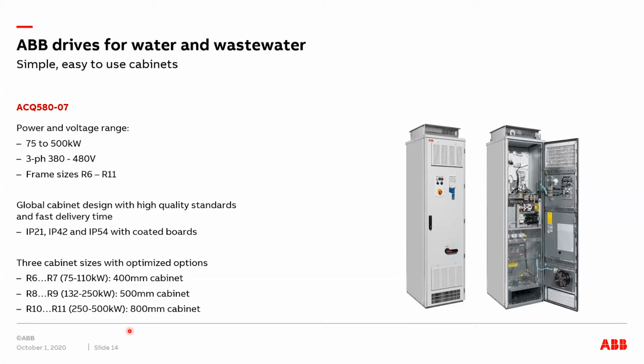And in total, there are 3 different frame sizes. There's actually more. There's R6 to the R11. So those are the ones, 75 to 110 kilowatt. That is basically 400 mil cabinets, then a 500 mil and an 800 mil. And the IP ratings available are IP21, 42, and 54.